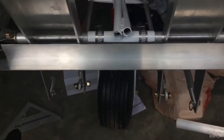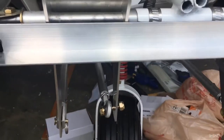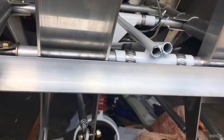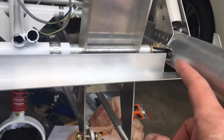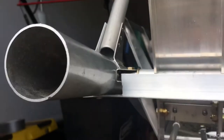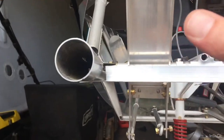I'm working on the mounting bracket for the battery. Here's the front brace for it — all you do is get a one-inch aluminum angle bracket. Home Depot sells this; a four-foot section is about $7.50 and you cut it with a hacksaw or bandsaw. It's got an attach point on the bottom — you drill the hole, put a bolt and fastener through, and use lock nuts. Then the other piece will be done up here in the front, and the battery will go in this way.